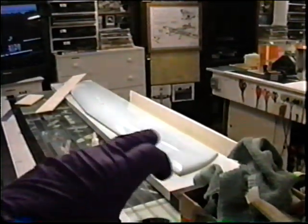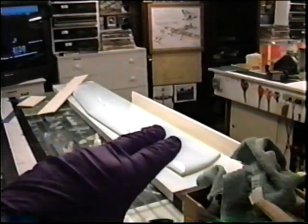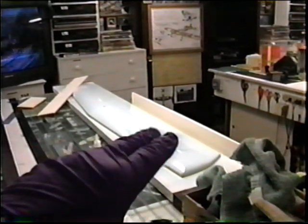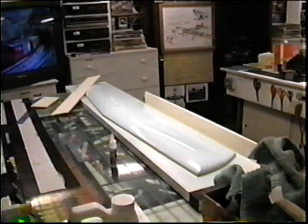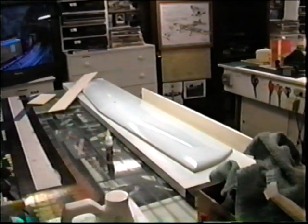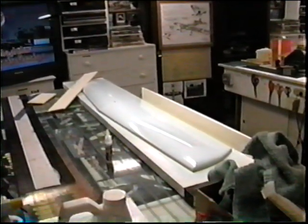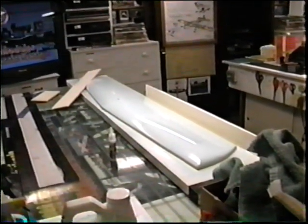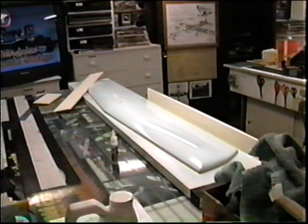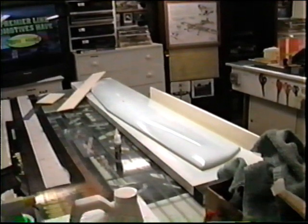I'm going to have to get 4 coats of wax on this, 2 hours apart. And then 2 or 3 coats of PVA on it to get it prepped for the day that we're actually going to do the mold. But this would be a good thing to take care of today with all the snow out there and building snowmen and everything. We expected to have a lot more snow, so we actually lucked out on this.